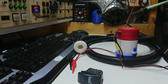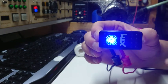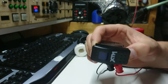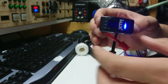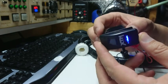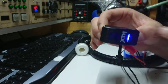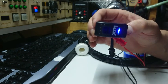Let's test with my little test clips and make sure that light actually illuminates. I'm wired up between pins 2 and 8 with 12 volts and it comes on nicely - the switch is going to work well. This also has an illumination light that's not dependent on the switch position. I don't have any dash illumination on the Argo so I'll probably leave that bit unused.